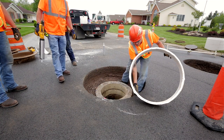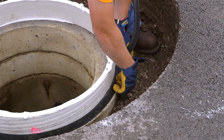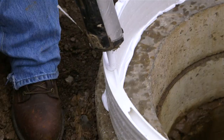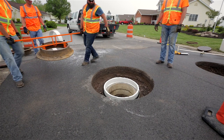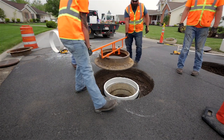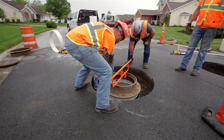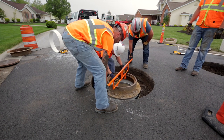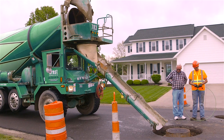It's bonded down with a white sealant. It has a piece of bentonite water stop that's applied around the outside of that joint. Another layer of sealant is applied, which adheres the frame to the liner, creates another watertight seal, and the frame is placed back on the liner.